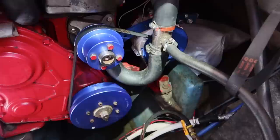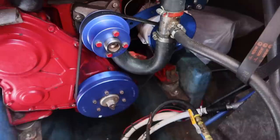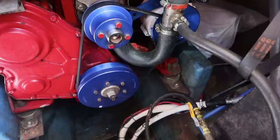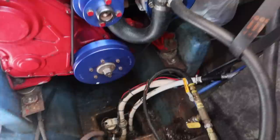It is a quick procedure just to swap on another belt, but you need to know where the tools are for the job. So now the belt has broken off and it's been sucked into some of the pulleys and is now making a horrible smoky rubber smell everywhere. The other issue, if this belt does break up, the strands, the hair-like cotton strands inside the belt that give it its strength, will now be all over the bilge and fall down into the bilge sump area. So you need to make sure you can collect as much of that as possible to prevent a bilge clog issue.